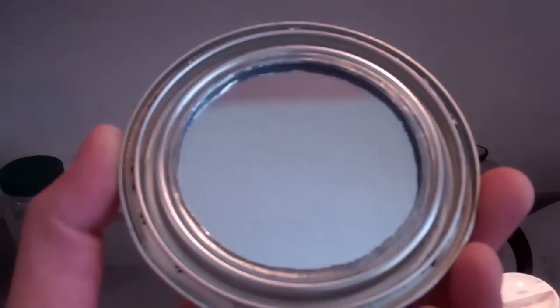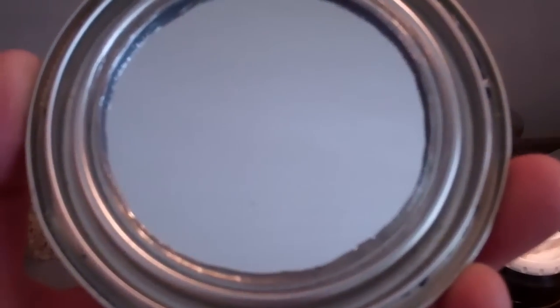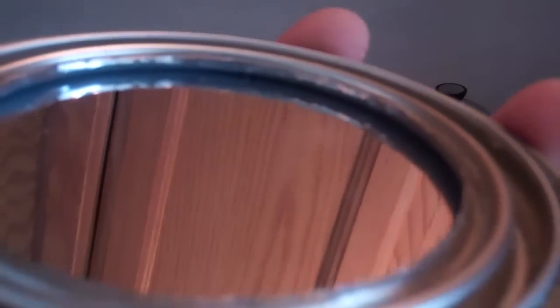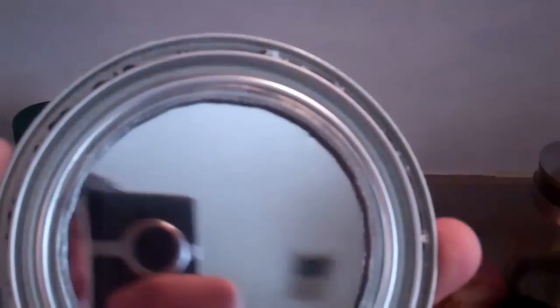We're going to tap that back down to try to get a more even stress on the diaphragm. Now here's a ridiculously large condenser microphone diaphragm — more than three inches in diameter — of stretched metalized poly. Remember the conductive surface is going to point away from the back plate; this ensures that if the diaphragm bottoms out it doesn't short the phantom power. Let's go to the next stage: preparing to measure and fit a back plate.